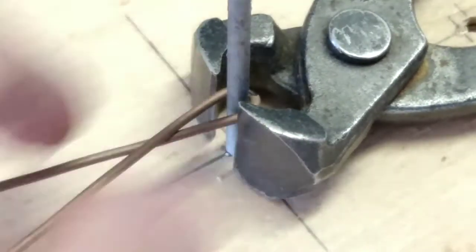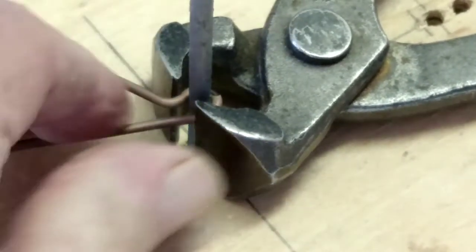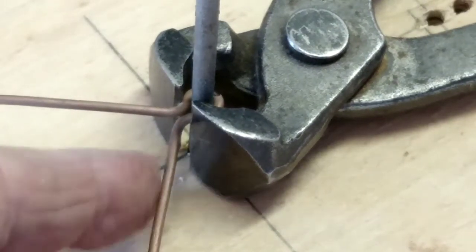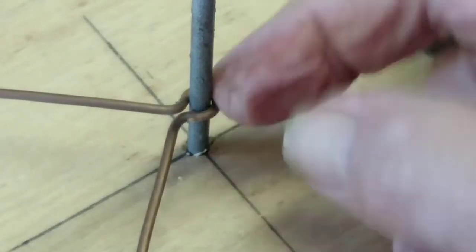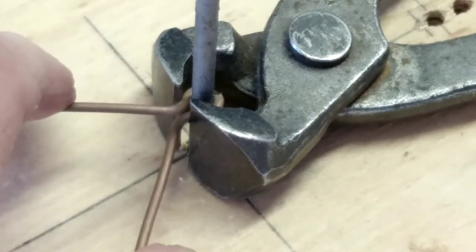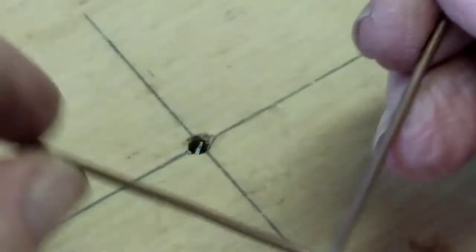And I take this pincher, end cutters, and I pinch it together. And as I'm pinching it, I pull that back. It's very nice. And then I squeeze it together again. Now for hoverman, there's a nice right angle there. And I've shown this before, and I kicked myself because the loop was off from the angles, and I had to adjust it later, but you can adjust it right now by pushing one of the arms back or pulling it forward, whichever you want to do. And you have to open it up, try to get it out of there. But it makes a nice little loop.